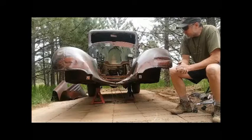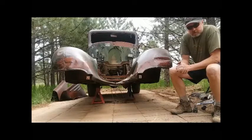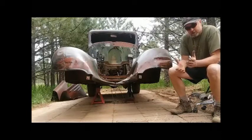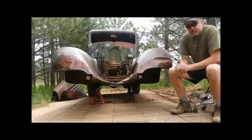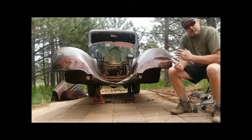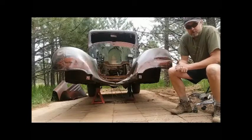Some of you are maybe wondering why take out this old stuff to put in some stuff that's, well, not as old but still quite old. The answer is pretty simple: those 47 to 54 Chevy pickups are pretty common and parts are really available. The entire aftermarket has got everything you need. That thing is really heavy. This little I-beam here with the leaf spring is going to be a lot lighter. They make disc brake conversions — you can get all the brake stuff, all the wheel bearings, steering components, pretty much everything. I paid $250 for the front end, the rear end, and the drive shaft. So I'll have hydraulic brakes. I'll think about putting discs on it maybe later.